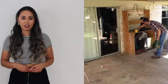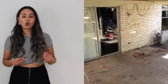This is the only prep work that we did and it is extremely important because paint is not going to adhere well to stuff that is dirty. So if you have any grease stains you're definitely going to want to use soap, an abrasive cleaner, floor cleaner — whatever will take off that grease. We used the pressure washer and that was it. That's all the prep that we did.